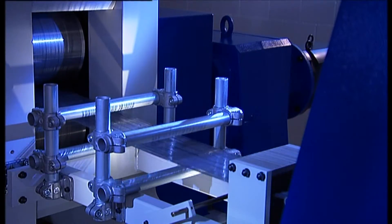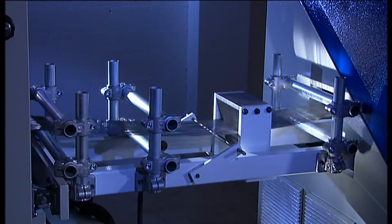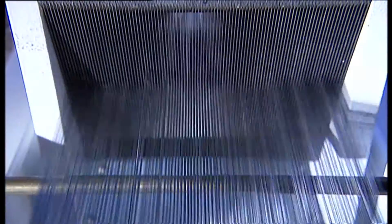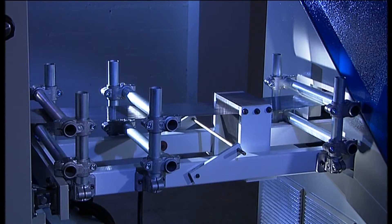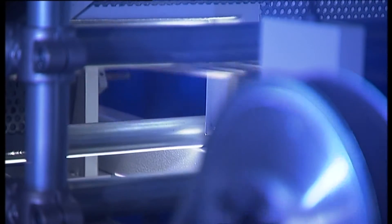Along this section, the wire feed-in length from the continuous feeder in the mill to the synchronized tool is regulated. While the wire is being bent and cut, the tool is closed. During this time, the wire in-feed from the auxiliary feeder is stopped and wire sag occurs.